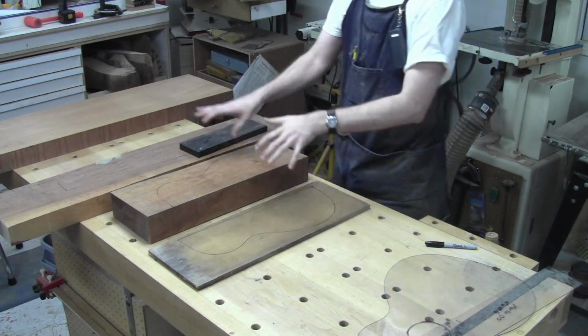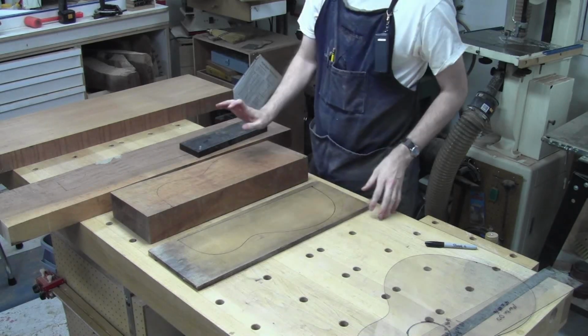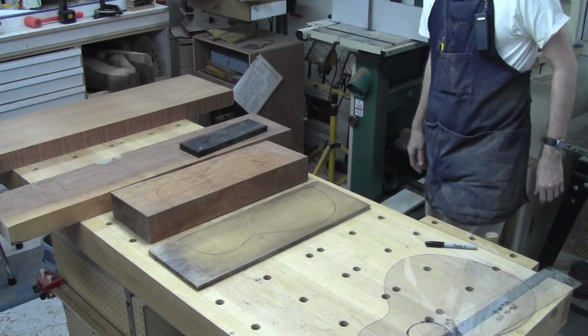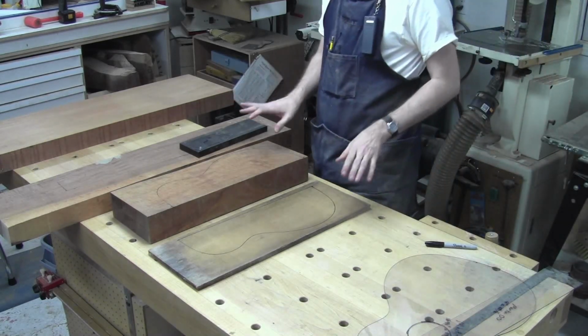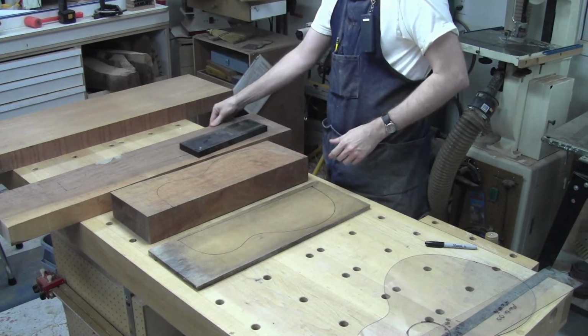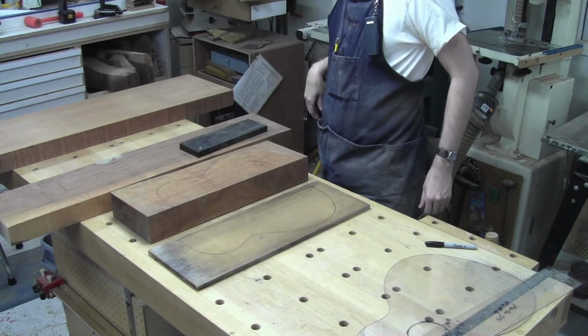For sanding, all of these are going to be real thin boards, so I'm going to do the drum sanding on them. So I figure I'll just slice off some pieces and then I'll drum sand them to thickness as necessary. So that's where we are. We're going to get ready to, I think, joint edge, and we're getting prepared so I can resaw, is what we're going to do. Is slice off.